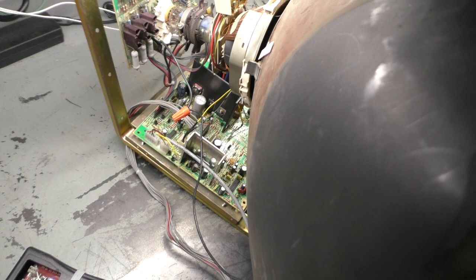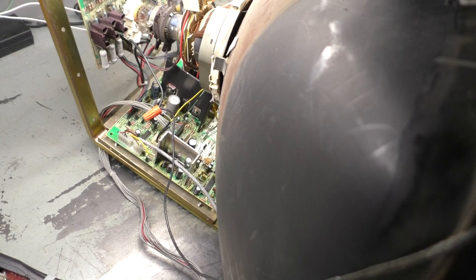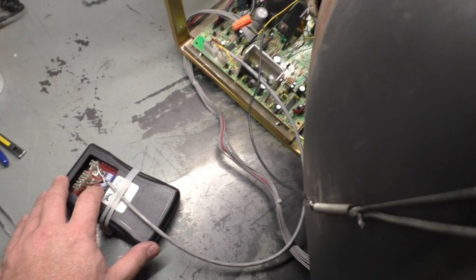And as soon as I got it, I inspected it, and it's somewhat butchered, but it does operate, and I wanted to verify that it actually had collapsed. I didn't see anything that was wrong, no solder bridges or anything that the person had done when they reflowed it. I didn't see any problems, so I wanted to test it before I really went any further. So if we turn the test pattern generator on, we're all hooked up. If I turn it on, it does turn on and operate.